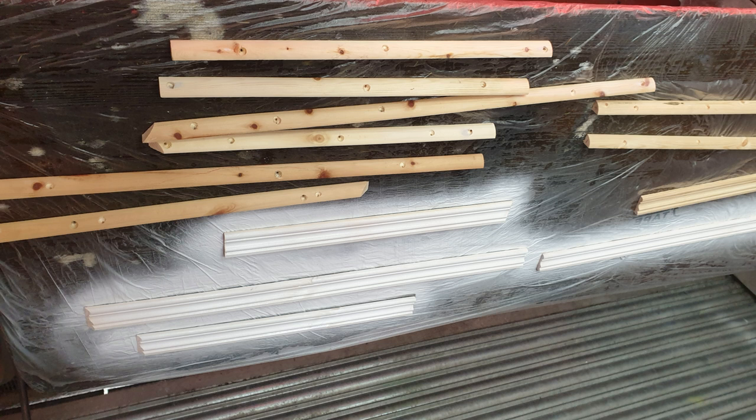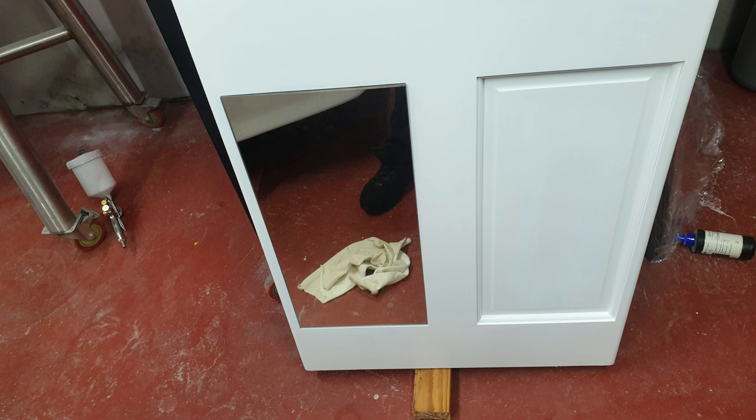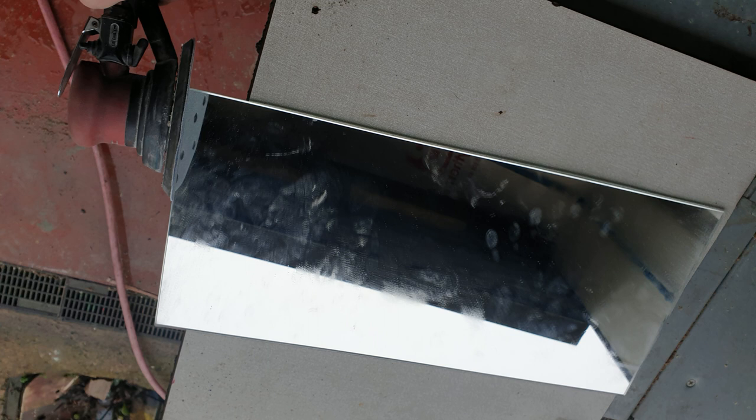So this is all the wee supports for the back of the shelves that were screwed into the existing studs in the wall. These studs were found using a magnet on the nails. This is me attaching a sample on the mirror in the door. It looked quite pretty at this stage. And then ready for the glass to be applied to all the three doors.